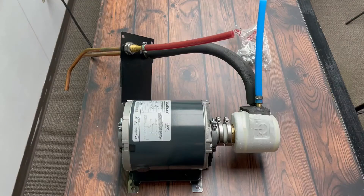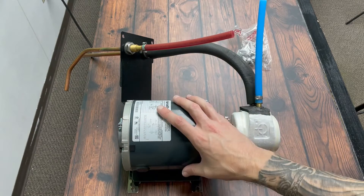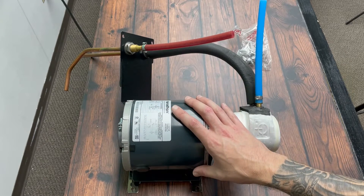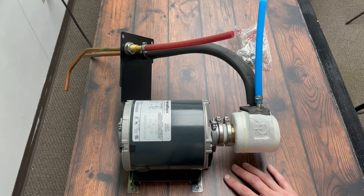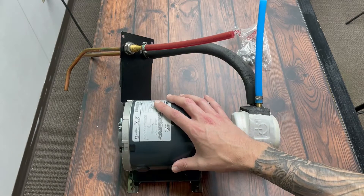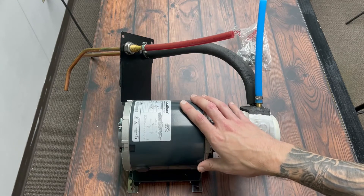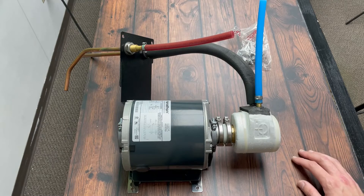First thing you want to do is turn off the pump or remove power to it. Sometimes your glycol chiller — the big black box — will have two of these motors on it. You can either unplug it directly from the wall if it's on the secondary motor, or if you're looking at the front of your chiller with the thermometer readout, you'll see a red and green switch. Turn off the green switch to stop the motor and stop liquid from being cycled through the pump. The primary motor is also plugged into the front of the chiller; you can unplug that as well.